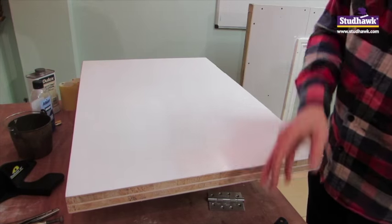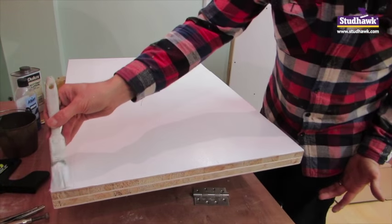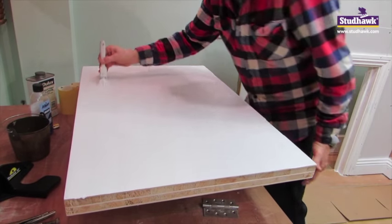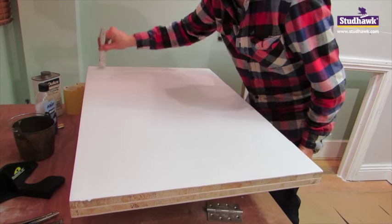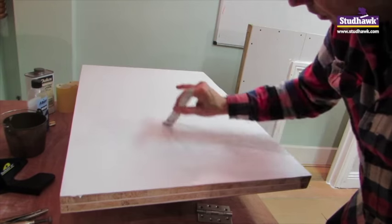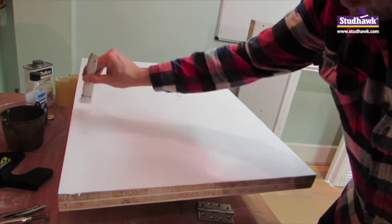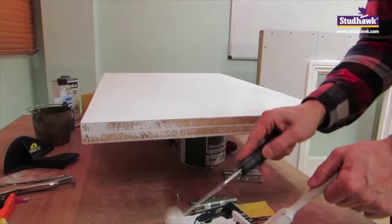It's just a number of coats — not trying to put too much paint on at once. If you are brushing out, use the weight of the brush, one pass at a time — that'll be for the brush finish. But you've got to be careful that you don't leave any marks in your brushwork. Very light pressure — that's what's known as laying off, to get a beautiful flat finish. We can use our roller on the edges as well, and then brush out again.